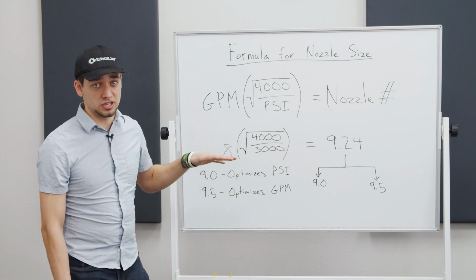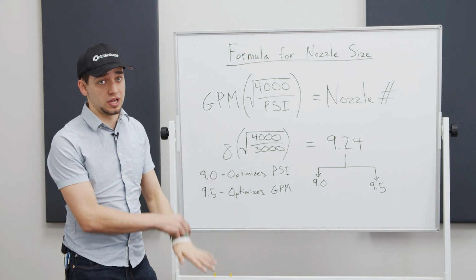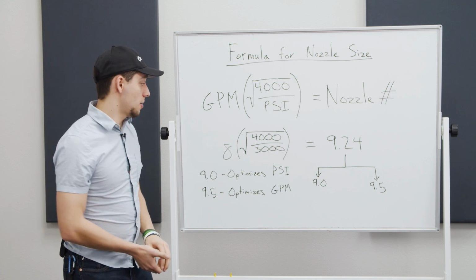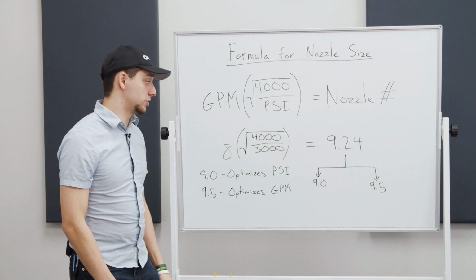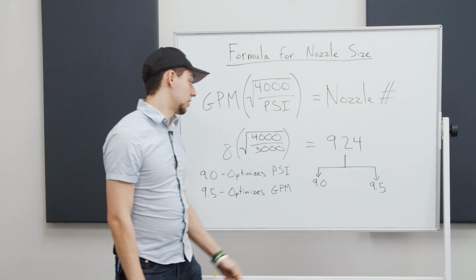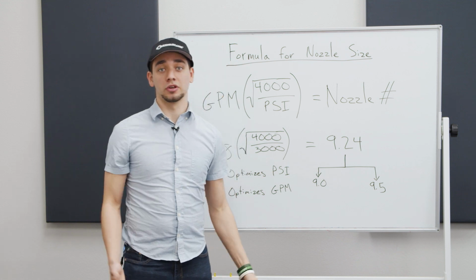If you go up in nozzle size, it's going to lower your PSI. If you go down in nozzle size, it's going to increase your PSI. That's just basic standard. It's up to you. We personally here at Powerwash.com recommend going up. We prefer going up rather than going down usually.